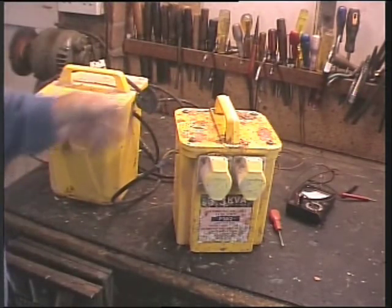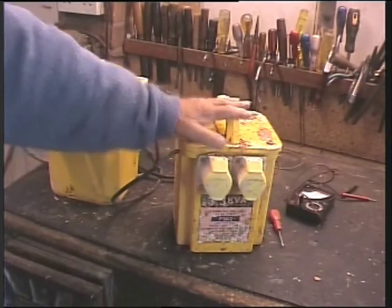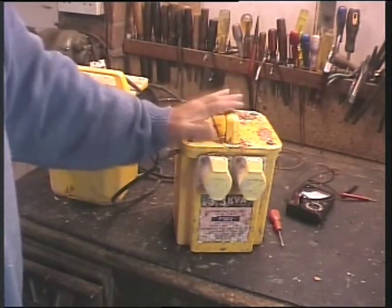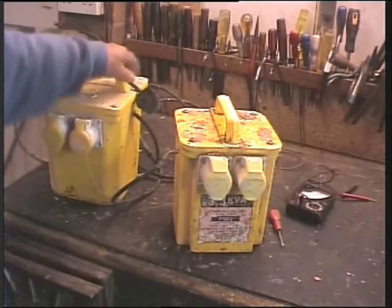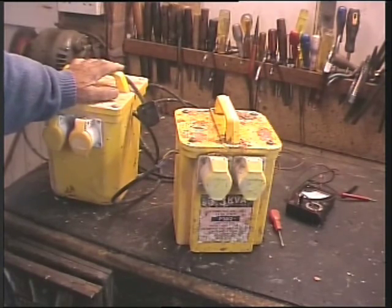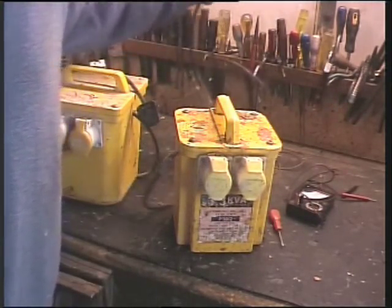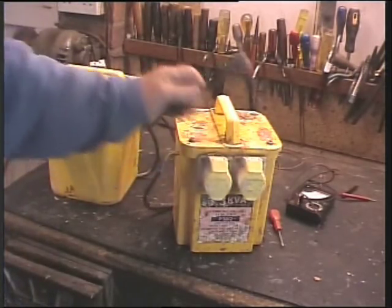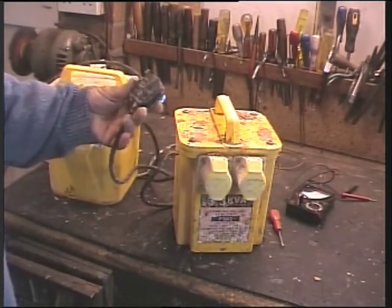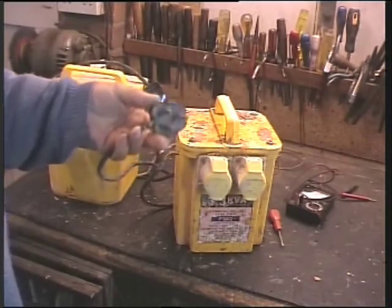But they're pretty messy. Before I plug in anything electrical that I don't know where it's come from, never seen it before, I always look at the voltage rating, the input voltage. Never assume it is for the UK. It could be foreign. Some plonker could have put the wrong plug on the end. So be safe to start with. Judging by the state of these, anything could happen. I've come across these things, welders and all sorts of things, and when you look in the plug, some bright idiot has replaced the fuse with silver paper or a nail. You'd blow up the power station before the nail went. Alright, I exaggerate, but you know my point.